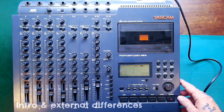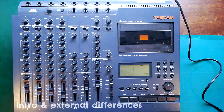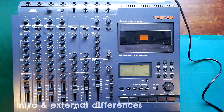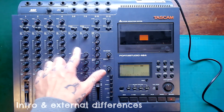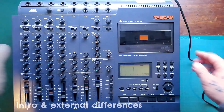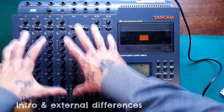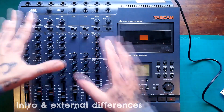The rest of the video is more for repair nerds, because when I first got this there was no audio coming out of the mixer at all. So I went through a process of trying to derive the expected voltage output from the PSU section from the schematic, and also what the cable functions were — because spoiler alert, it turned out the power was all right but there was no audio getting to the mixer. I partly disassemble this so the mixer is naked and separated electrically from the lower part.